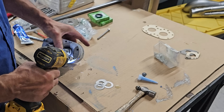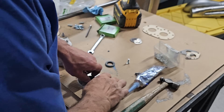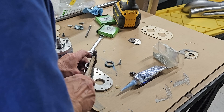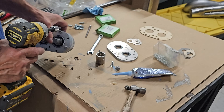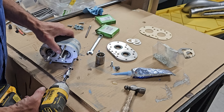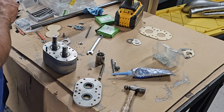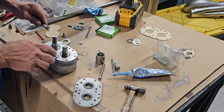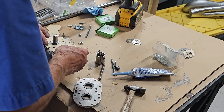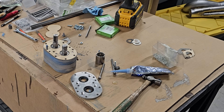One more time, run these machine screws all the way through, tighten up the last pockets before we put on what's going to be our last plate — and that is our seals. Just as in any automotive application where you've got grease contained or you're trying to keep moisture out, the seals sit on that shaft. We're going to put just a light film of lubricant on there so that the seals will slide on and stay lubricated from now until the end of days. Everything is lubed up, seals pressed in, ready to go. One last gasket and we'll slide this thing on.